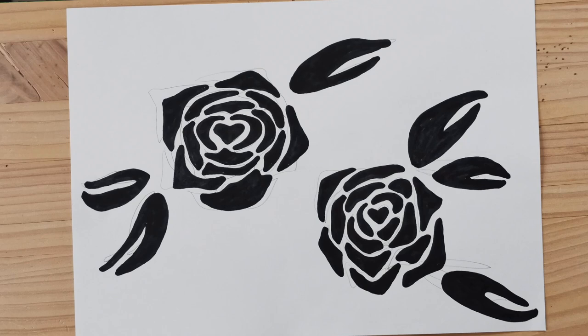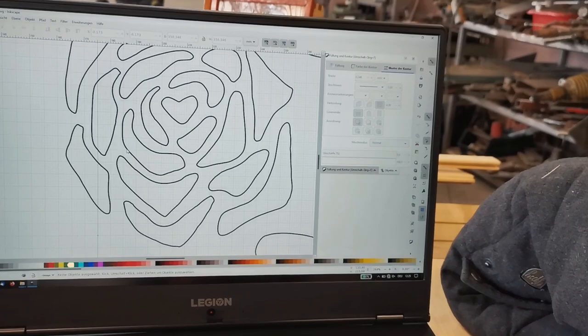The design for the laptop tray for my sister was done a bit differently. We started out by her drawing a flower kind of design with edding onto a white sheet of paper. We then photographed that sheet of paper and digitized her shapes using the trace bitmap feature of Inkscape. I was then able to modify the individual shapes digitally to ensure that I would be able to actually cut them later on. After finishing both of the designs, I loaded them to my Shaper Origin and cut them out using the included 3mm standard bit so that I was able to get into the small ridges and grooves of all of the shapes.